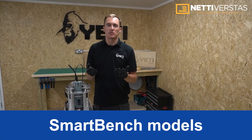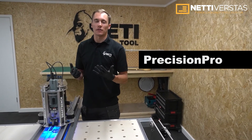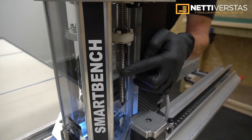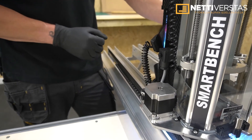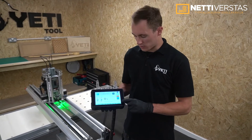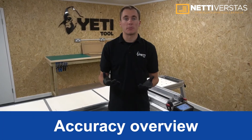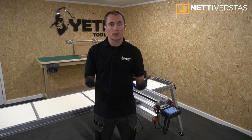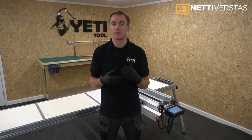We have three different models of SmartBench: the Standard, the Precision, and the Precision Pro. The Precision Pro is our most commonly purchased model and includes laser datum — a crosshair that allows you to quickly and accurately set the datum for your job — dual z-axis lead screws which reduce deflection during plunges and retracts, and on-screen spindle overload feedback in real time. We publish the accuracy of your finished part — plus or minus half a millimetre or better — which depends on your CAM strategy, feeds and speeds, and the condition of your tools.